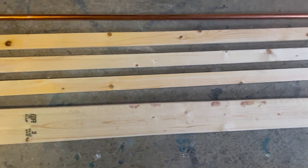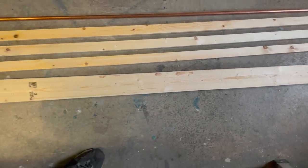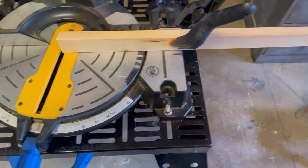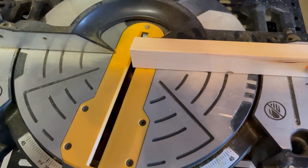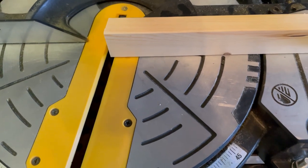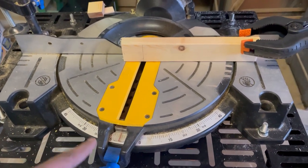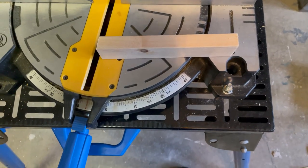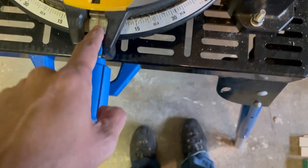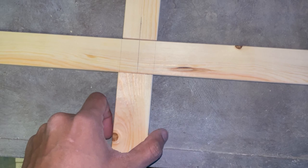For project four, I wanted to create my own floor lamp, so I'm going to DIY this using spruce wood. We're going to need four cuts of 50-inch wood. We have three cuts already and we're going to be using a copper pipe for the center. The important thing to create this is making 10-degree cuts for the tripod. Those four pieces of wood are cut at the 10-degree angle. The base, which will look like an X, will also be cut at the 10-degree angle — inside cuts are straight and the outside cuts will be beveled to match.